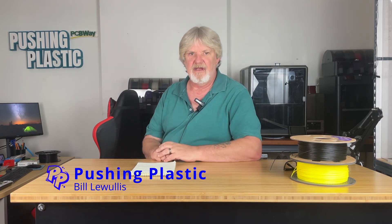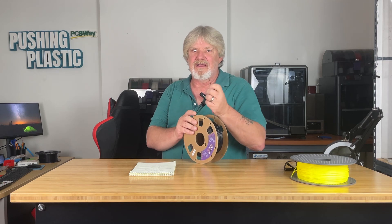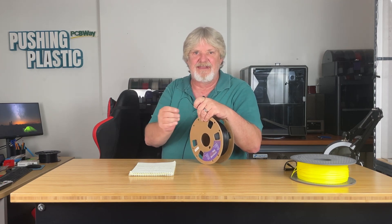Okay, let's get into it. The first thing we want to do is have dry filament. TPU is known for easily absorbing moisture from the air. I dry my TPU for about four to six hours in this dryer I got from Fixdry — if you have an interest in a filament dryer, I have a link for this unit in the description. We'll also have to make a few adjustments to the printer. Printing TPU isn't going to work by putting the spool on the back and running it through the Bowden tube, because TPU is very flexible like string and it's difficult to pass through the tube.